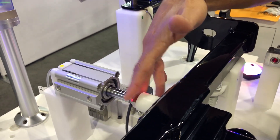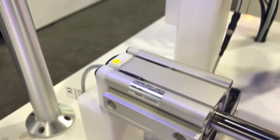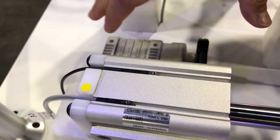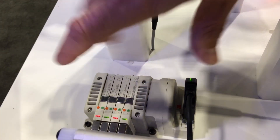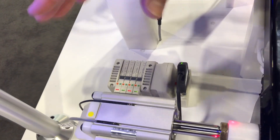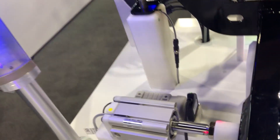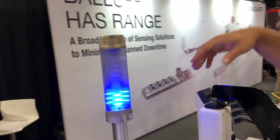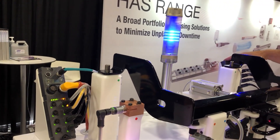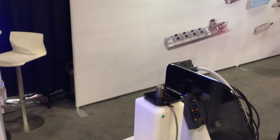In this case, we can take our cylinder and we have some cylinder switches that can tell us whether it is in the extended position or in the retracted position. You can use this valve in an automated process — we would use this valve bank to actually work this cylinder back and forth. We have a smart light back here where we can interface with our IO Link master, and then we have an IO Link actuator hub that takes all of our IO into here and interfaces with our PLC.